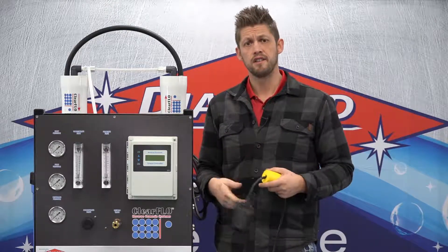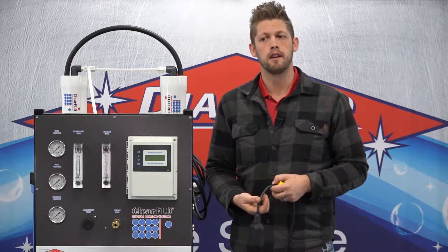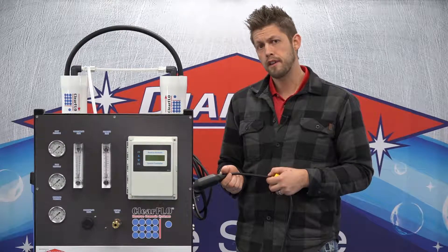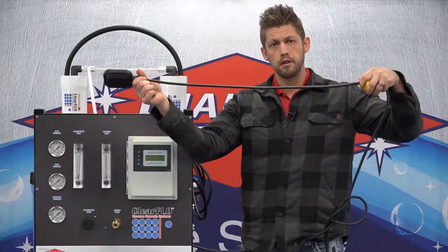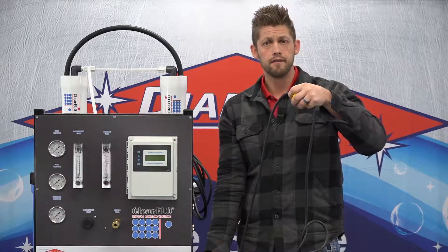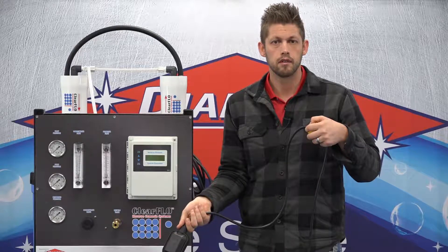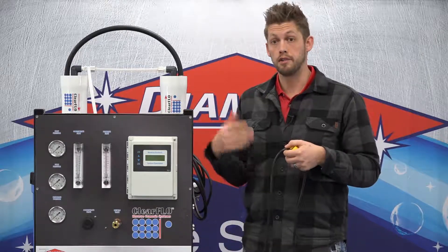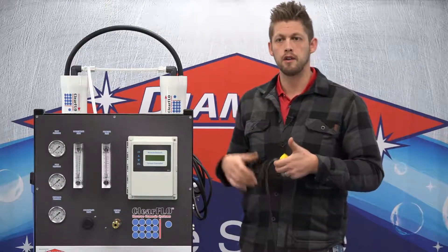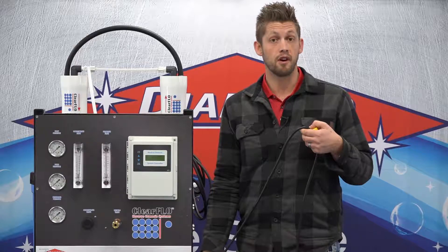Now, let's say you've got an application where it's very low volume usage. You maybe still have that same 900 gallon tank, but maybe your water usage is only 900 gallons per day. In a scenario like this, you're going to want to set your float a little bit longer. The reason is you want to make sure that when your RO turns on, it runs for a sustained period of time. You don't want it turning on and off in a matter of minutes. You want to allow it to run because when it is running, it is also cleaning itself and keeping the TDS down. If your membranes and pump are working properly, you're rejecting those impurities — you want to allow that pump to run rather than start and stop.